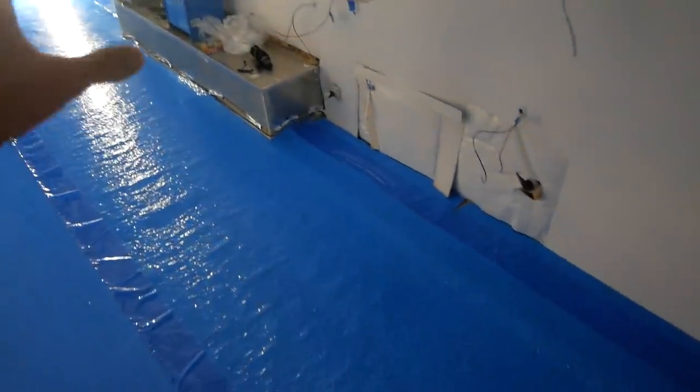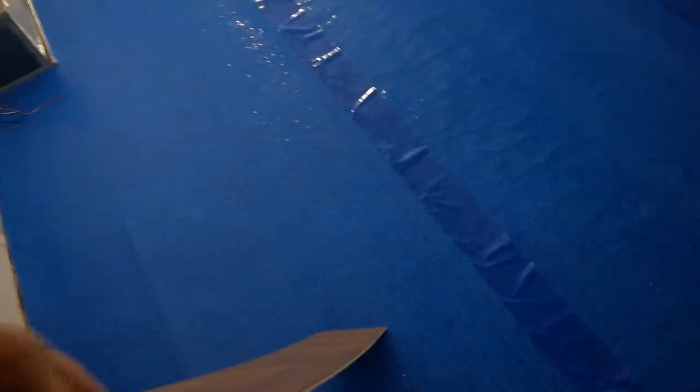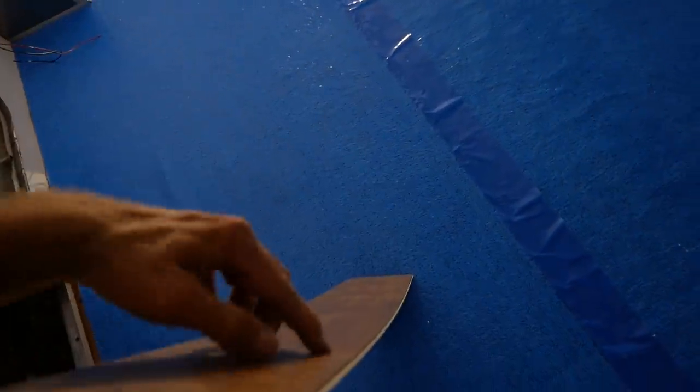Okay, underlayment is in. That was fairly easy. It took pretty quick. It's a bright light over there, sorry. It's been a long time since I have laid flooring, but I'm just gonna start against this wall, move my way that way. The first row, I suppose I'll cut the tab off right there and just go for it.